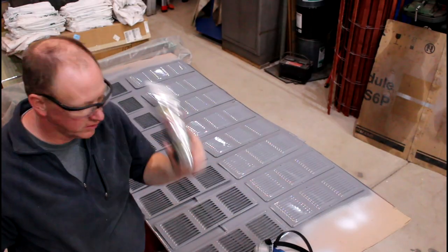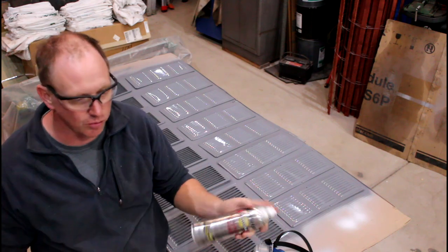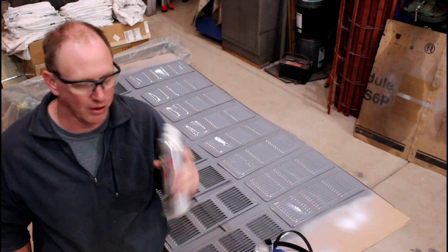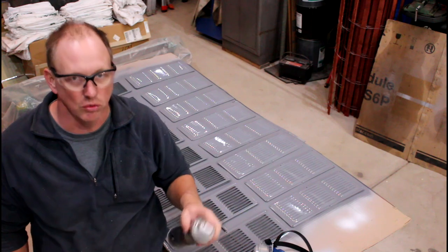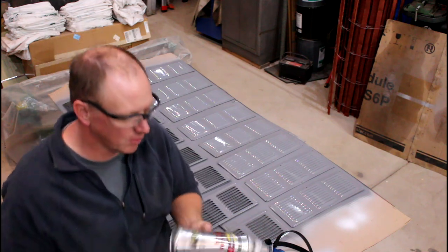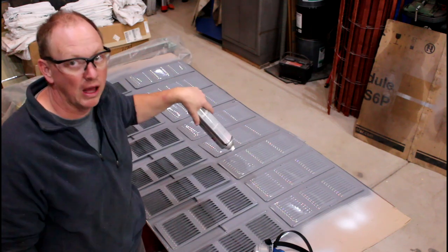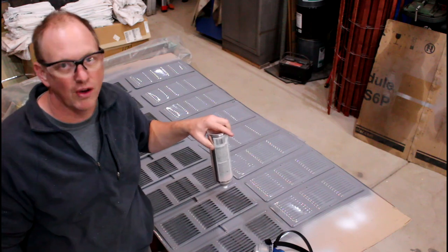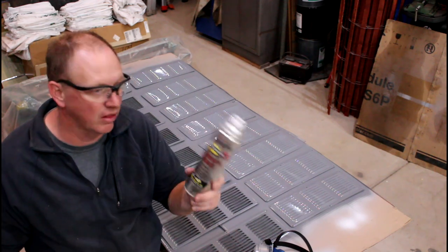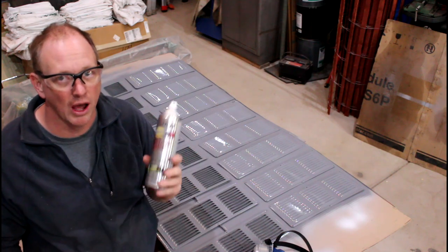The top coat is all done. One thing I noticed: these cans say you can spray at any angle including upside down, and that's true - but when you get down to about a third of the can, you no longer have as much spray angle available and you have to come back to fairly standard spray angle. So if you want to spray upside down the whole time, it's not going to work for the full can. For the top coat I used two full cans and got three coats on here - 45 square feet from two cans, about 22.5 square feet per can.